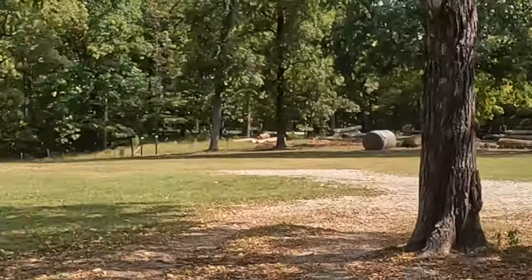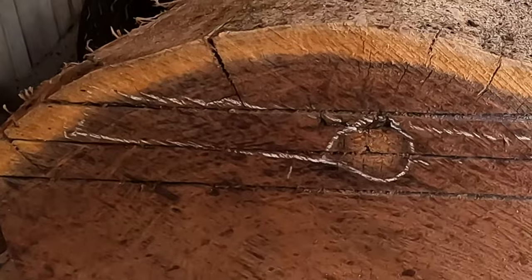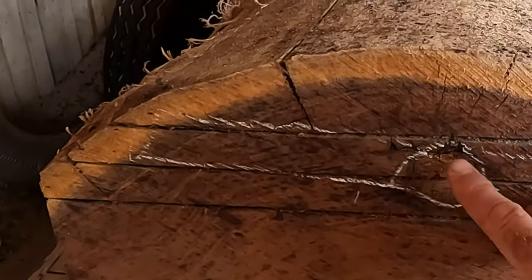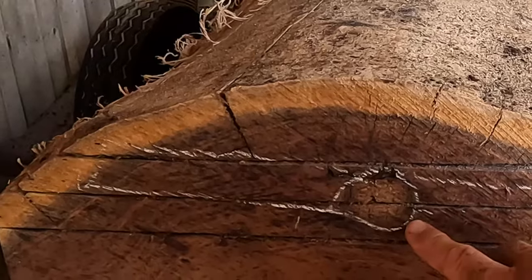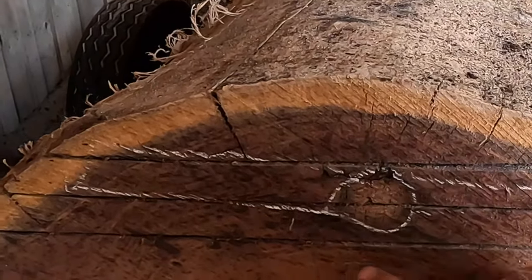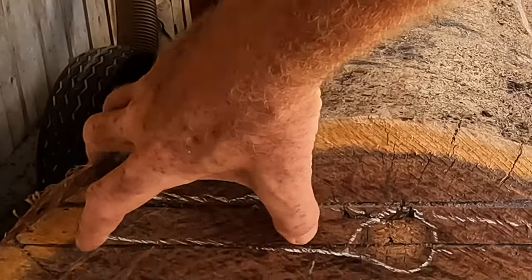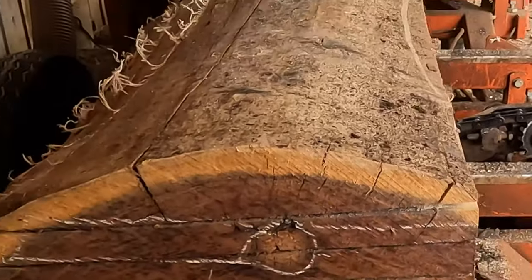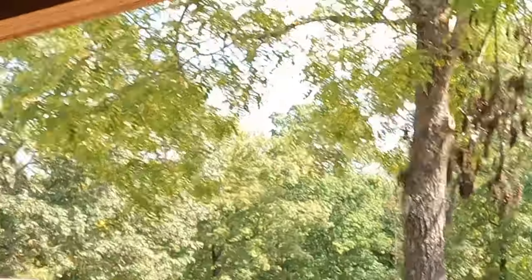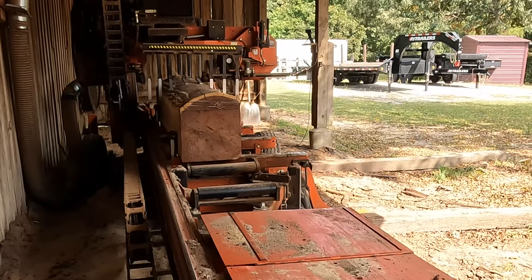So it's kind of hard to explain this sometimes. When I'm looking at this defect right here, I don't believe there's a nail in there — or I didn't believe there was. I think there was one that used to be there. This is too much to be covered by one board, so I'm going to extract it in two. I'm going to make sure there's a clean face here and a clean face here. NHLA rules require four inches — I'll have wider than four there, wider than four there, right at four there. So I'll have four boards out of this as long as I don't hit that nail that's not in there. And I didn't hit that nail. So I'm happy. Let's keep sawing.